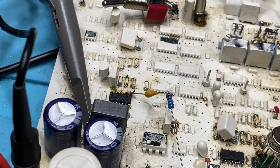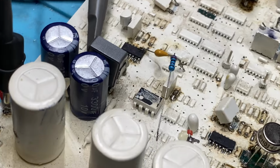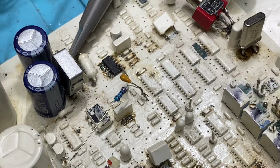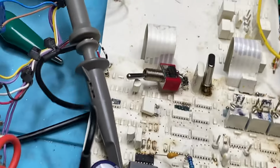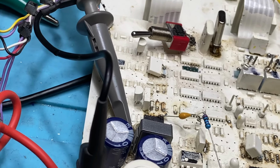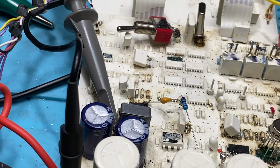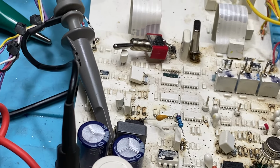Anyway, what we want to do, main mission was, I was going to rip everything out, and behind there's a diode in there down the bottom there, which you just cut the leg on, not that thing, but it's under the block, it's under the inductor, and yeah, cut a leg on that, and it disables that noisy 5-volt supply. But we'll go back to the old way we did it, which actually I re-looked at it all, and it's not too bad.